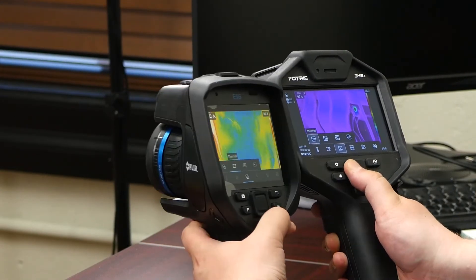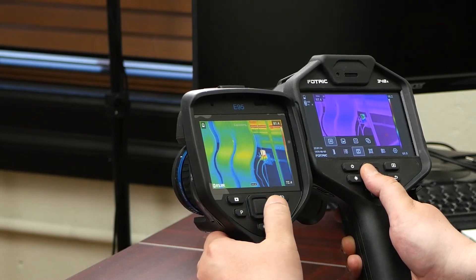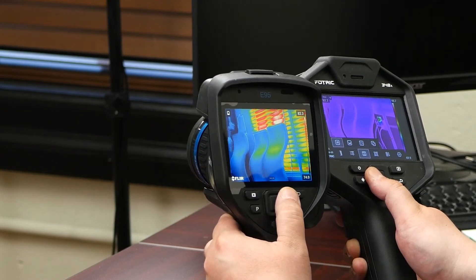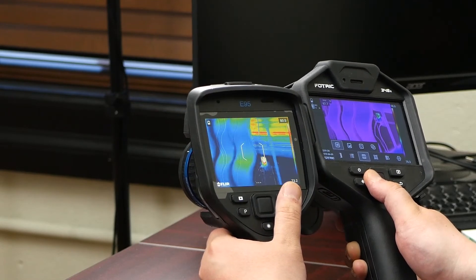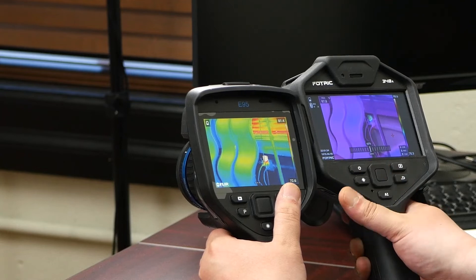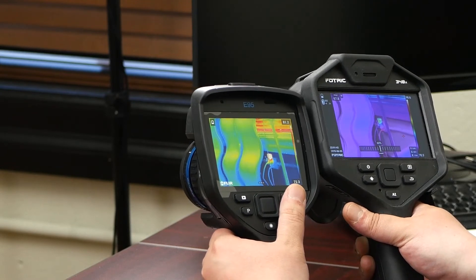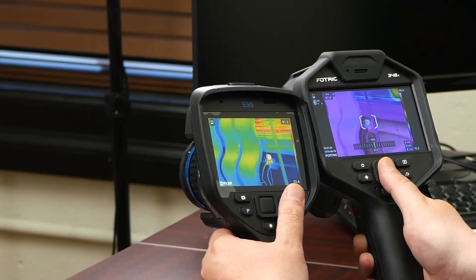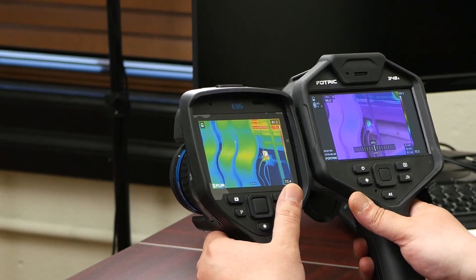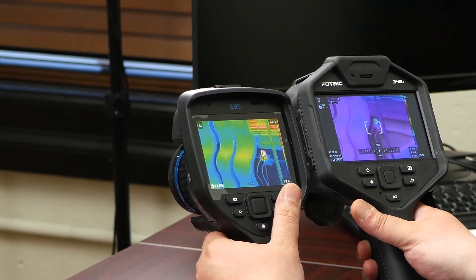To show you this image mode — the MSX that I was talking about — here's FLIR's MSX, which is really useful when you're dealing with small gradients in temperature and relatively uniform surfaces thermally, just to give you a sense of what's going on optically when you're writing a report later. You can see how FLIR is just a little less squishy, a little smarter. You get that ghosting effect when you do the fusion blending because they need to do a parallax realignment in the software, and sometimes it's really good and sometimes it's off.